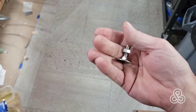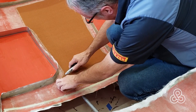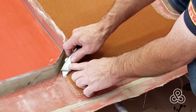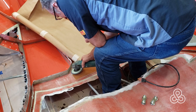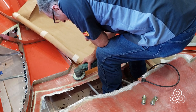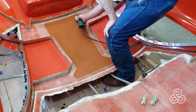I forgot to account for these elevator bolts — there's a door hinge going in here and the Nomex honeycomb is actually in my way. I should have cut it further back. So I'm going to remove a little bit of that Nomex material so we can get those elevator bolts in there. I use elevator bolts because they've got such a wide flange that just bonding them to the surface is enough to hold pretty good strength. Once I've got the Nomex cut away, I need to go back and re-grind that 45 degree bevel and get a nice smooth edge on there.